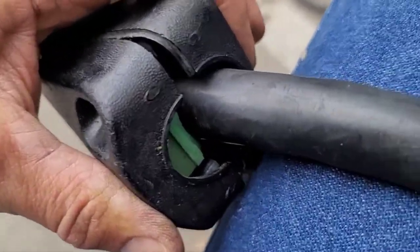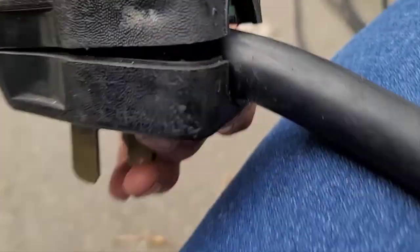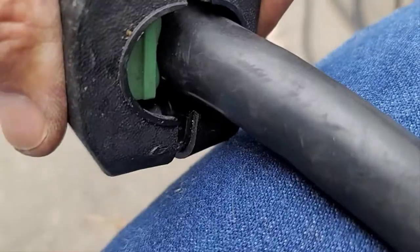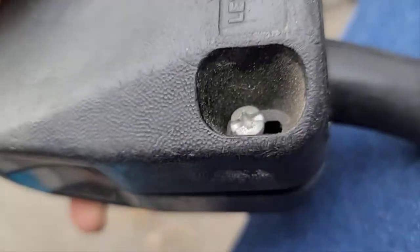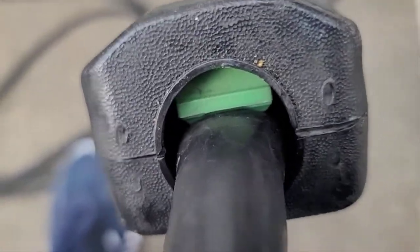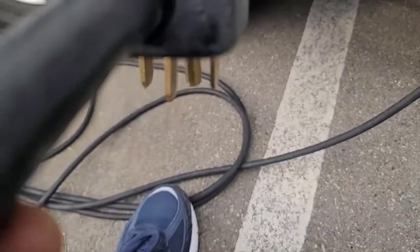I put the strain relief back in because there was no strain relief. I torqued the screws down, now I'm gonna squash this round cable — it should be pretty firm. I'm gently tightening these up alternating back and forth. That's what it should look like — squinching down on it, it's flattened it down a little bit.